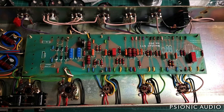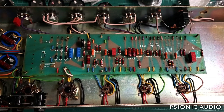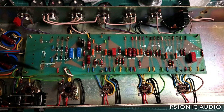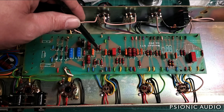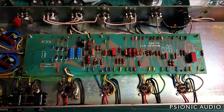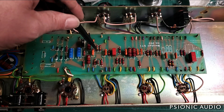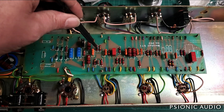The 2203 circuit for 6550s differs from the circuit for EL34s in usually three places - in this case, only two. Number one, the 6550s often have 150K or even 82K here. I believe I measured these are 150K. And these are usually 150 or 220K with EL34s. The difference between 150K and 220K is not huge - the amp still has tons of low end with these, so these can stay.